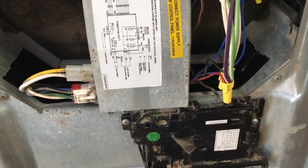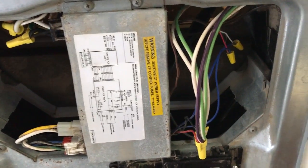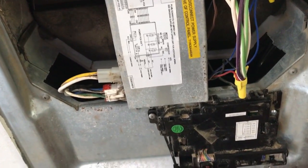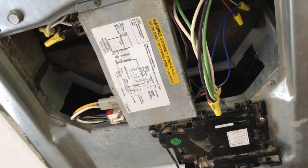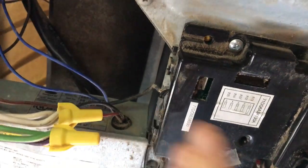I had all this off last week and put it back together because I didn't want to leave the AC unbolted for an extended period in case it rained — didn't want it to suck down the AC and squish the gasket. What I had done is pulled this apart and was able to go up and see the actual blower. But you can't get the fan out from in here — you're gonna have to go up on the roof, and there's not enough room to get the blower out to get it off the shaft.